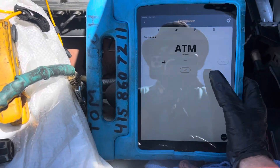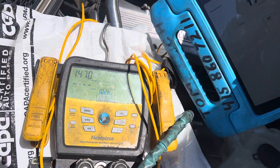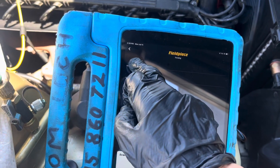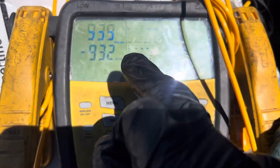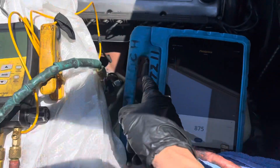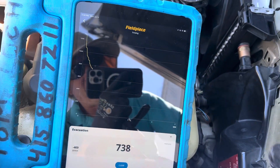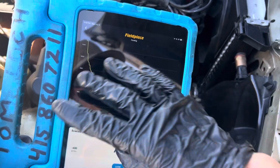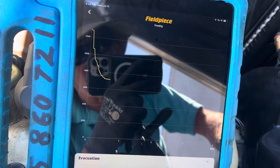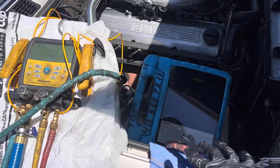You'll see this move once it gets into the microns — it's still at 28. Now we're in the microns, see 14, 12 — let's data graph that. You can see it starting right there at 12, we're down to 9 now. There's a little software lag, but you can see the micron range going down, down, down. With a set of analog gauges you cannot measure this kind of vacuum — analog gauges stop at 29.9 inches. This is much, much deeper than that and you can actually see it. We're starting to level out, taking vacuum off both high side and low side simultaneously.